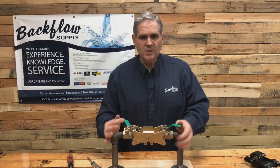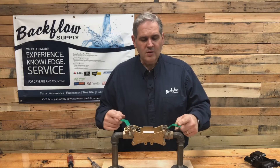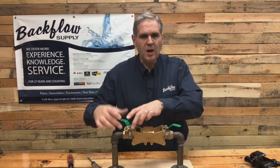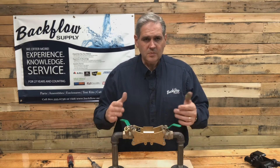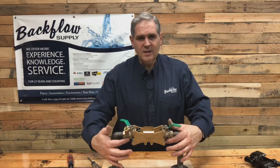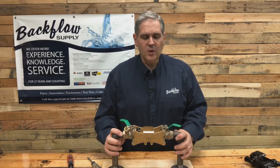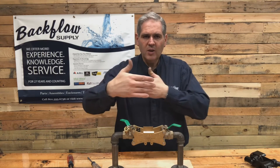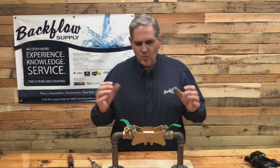I would then turn your shutoff valves to a 45 with the handles — that's leaving the ball valve partway open. There's a ball inside each of these valves. If it's all the way open or all the way shut, it traps water on the side of the ball, and that tends to be where you'll get cracks during the winter. Leaving it partway open leaves room for the water to expand around both sides of that ball to the open end.